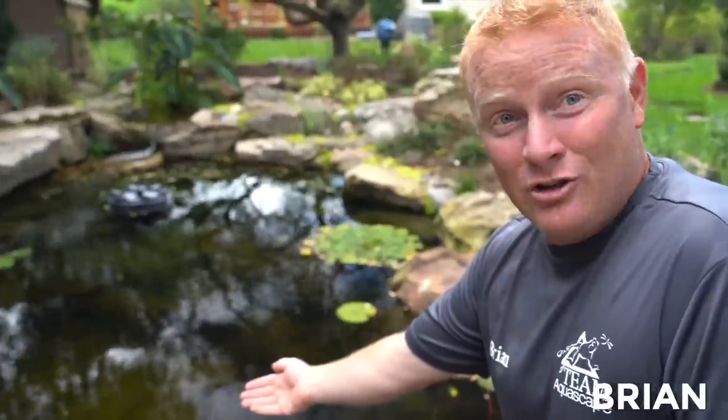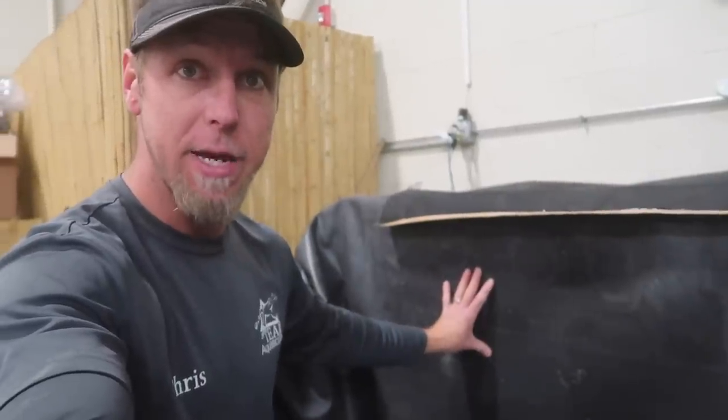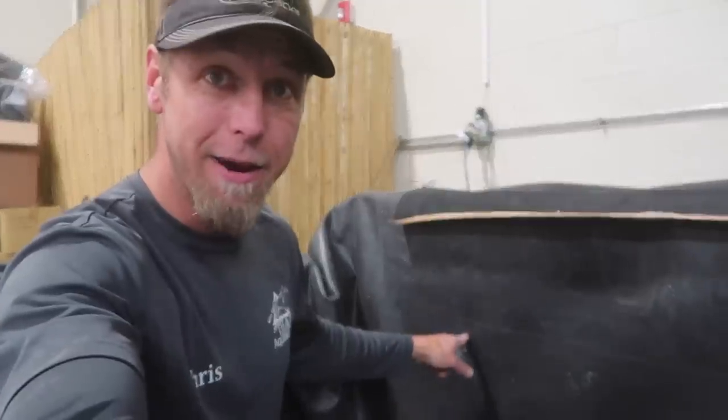So what does that mean for us? Time to get back cracking on the fish retailing area. To start the day, I am going to prime the liner here, put a piece of cover tape down, and then I am going to make my penetrations in the liner. This is where those four three-inch bulkhead fittings are going to go, and this is going to be our intake area.